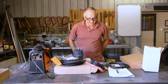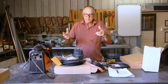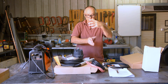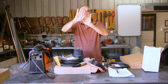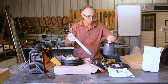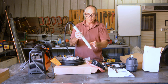So this is my new cutter. I'm excited to get to the next part, which is mounting the torch — the current mount on my table is for the hand torch, so I've got to make a new mount. I'm probably going to have a new backing plate with some clamps to hold this. It's very important that the torch is held 90 degrees to the job, and also not leaning in or out. So there'll be a little bit of work to do there.